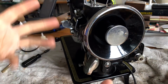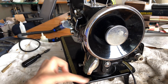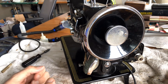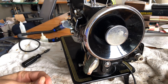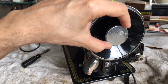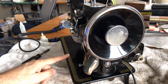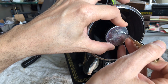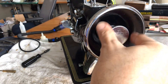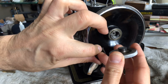I am sort of working my way around. I don't do this often because it adds significantly to the time I spend overhauling machines, but I like to give little windows sometimes as to how I approach a particular machine — going into different sections when you're doing an overhaul. This, of course, is the clutch knob. This is the knob that you turn when you want to disengage the needle bar and wind a bobbin. I am actually going to loosen the set screw here and take the clutch knob off. This is something you don't really have to do often — this is really part of an overhaul or a really deep tuning of a sewing machine.